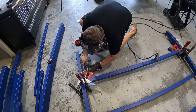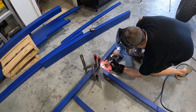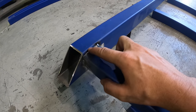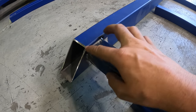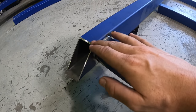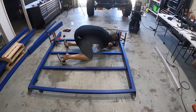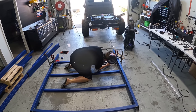No porosity in that one, mate. Right, so that's left us with the perfect 4 mil rebate. So pretty much our sheet will come across and it'll just butt up nicely to that, and we can get a Sikaflex join. That's why we're doing it like that. It's all looking pretty good. Nice and short tray.